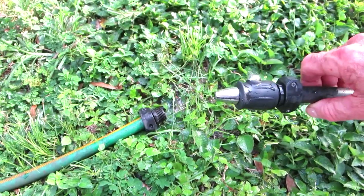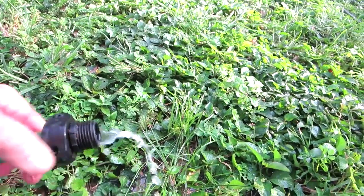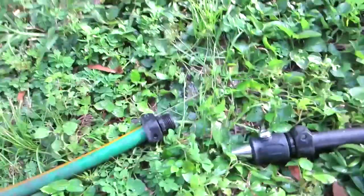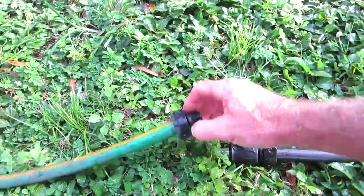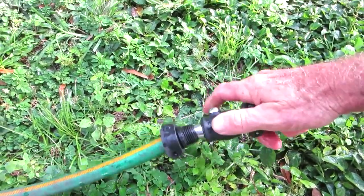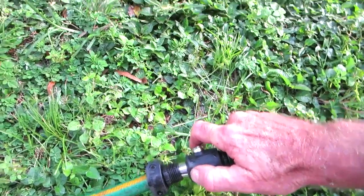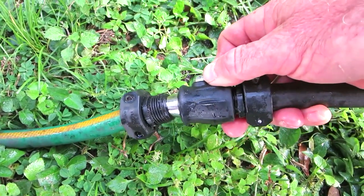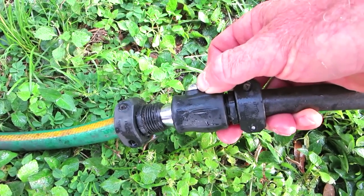This is what I did: I got a regular hose out here, got the end of this - really wanted to get fancy, put a female end on it, screwed it onto that hose to push water back up into it. I'm starting to get calcium out. I have the hot water on in the sink so that has relief, and then I'm turning on the water and spraying it back into the water heater. This should blow the water back up through that drain and push the calcium deposits out of the way.